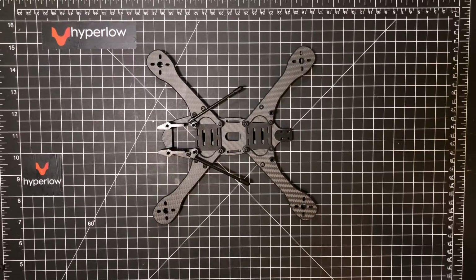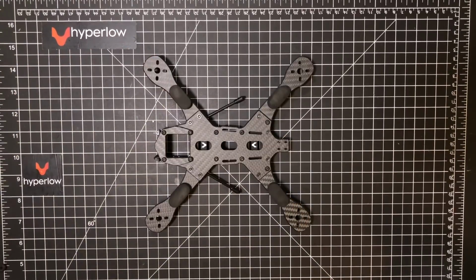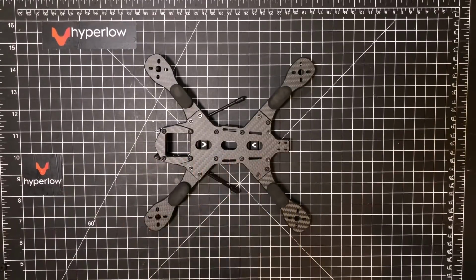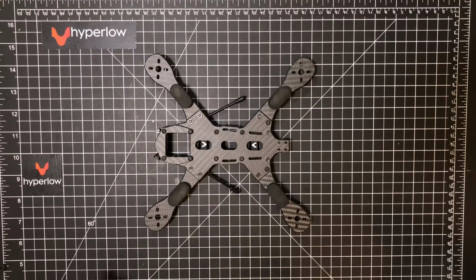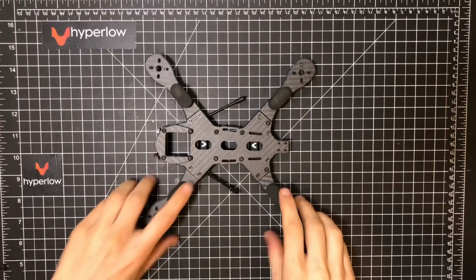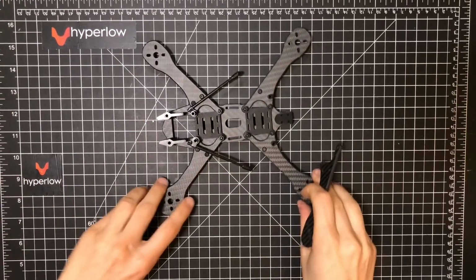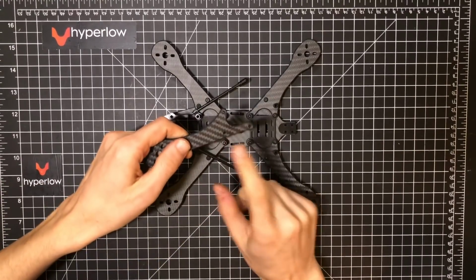And this all starts with the frame layout itself. It's designed around the FC mounting pattern, which doesn't just exist in the center, it exists all the way down the frame. And this provides a horizontal map for all your electronics, so you're building down the frame instead of up, which is a perfect fit for a low profile top mount design. And attaching itself to these FC patterns and the peripheral mounting points here is the new 4 mounting point arm.